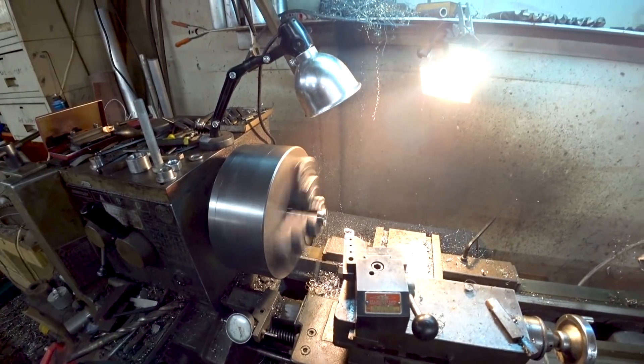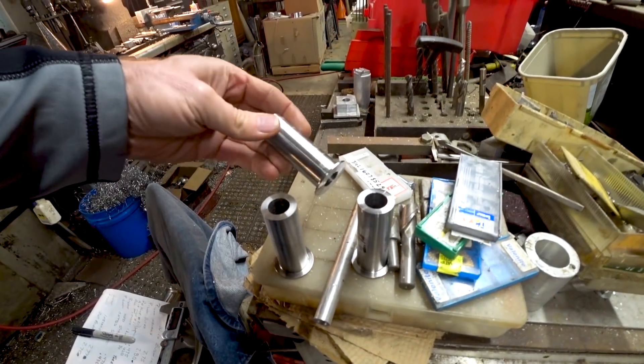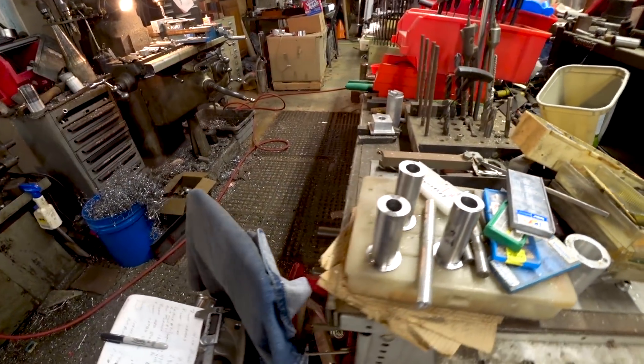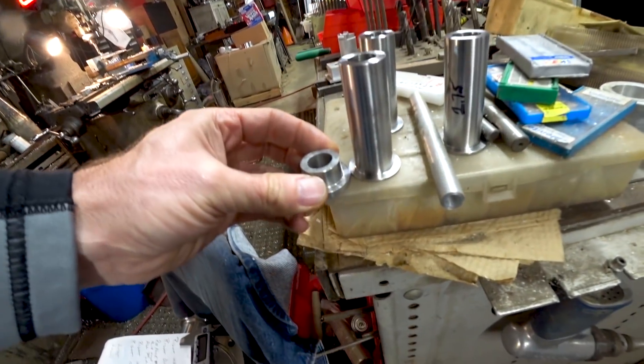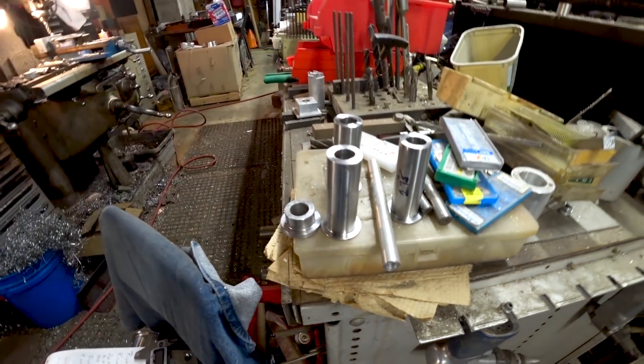Welcome back. The second half of the week started out with me back up at Brit's again working on the lathe. This time it's these bushings that hold the wings on. I had to shorten them a little bit and also narrow out the flanges - you can see that one there has a thicker flange, and I had to take them down from 3/16th to 1/16th.